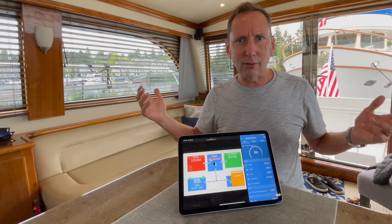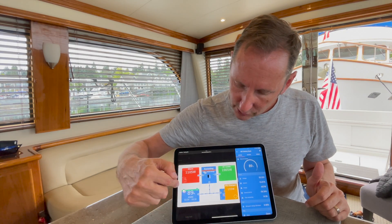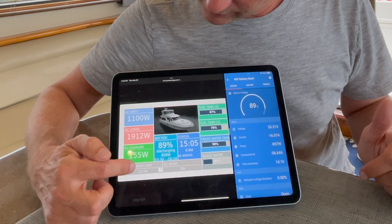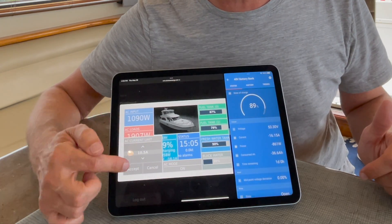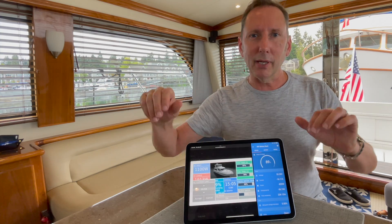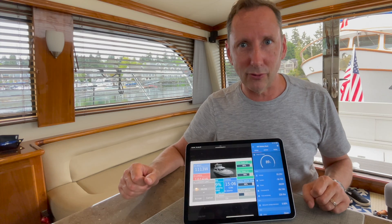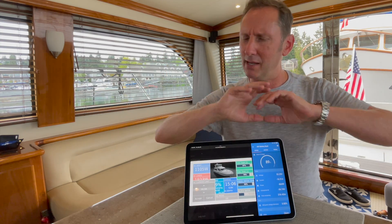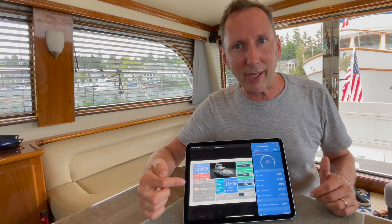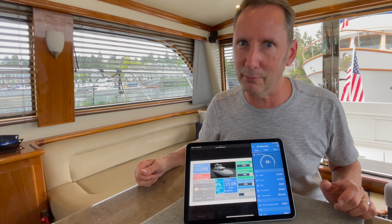To set this up, it's pretty straightforward. On this screen, you'll notice at the bottom it says 'current limit,' and you can adjust it up and down. I said 20 amps, and you'll notice it says 10.5 here — that's because we run our boat in split phase. We've converted our 120 volt shore power to 240 volt, which halves our amperage. We do that because that's what this system demands — we'll go deeper into that in another video. But the cool part is you can adjust right here in the user interface how much power you're going to draw from the dock, so you never have to worry about flipping a breaker again.